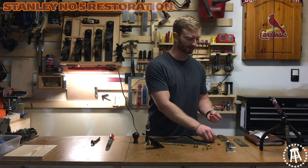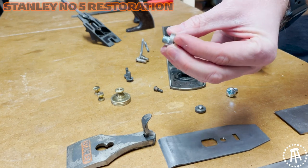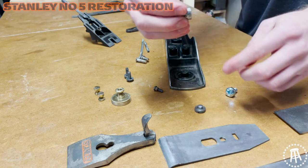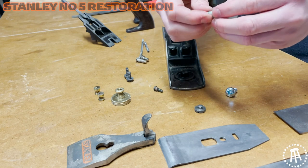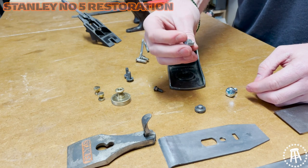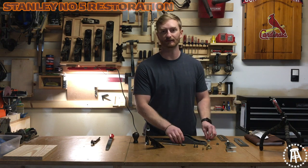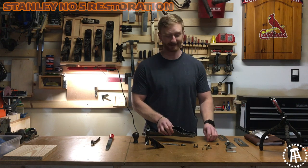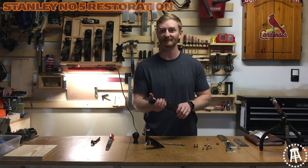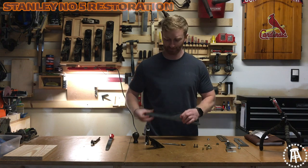So we had to go to work on the grinder. I took a Dremel tool, marked out how far down I needed to go, cut it down with a cutoff wheel, ground the head flat, and then ground the sides flat. It's not going to win any beauty contests, but it works. I tried to make this a good intro to restoring or preserving planes. Sorry, you get more than what you paid for here though.